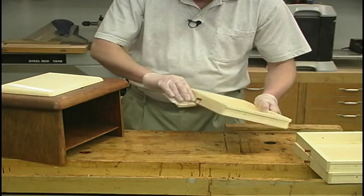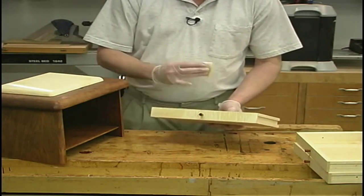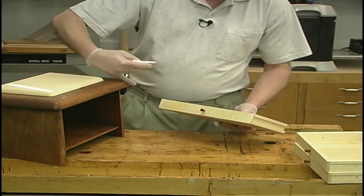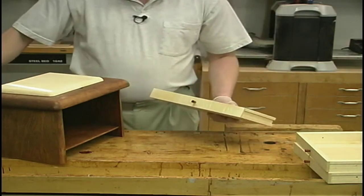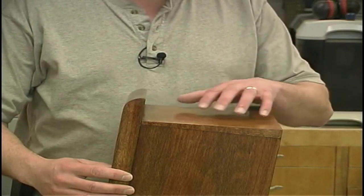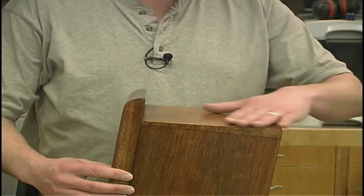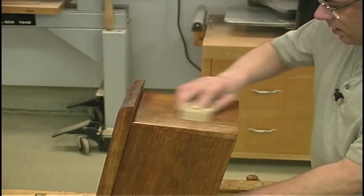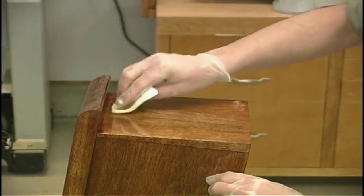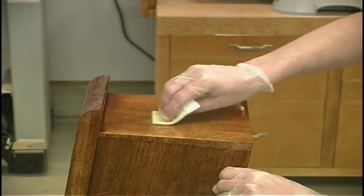I'm wiping on the top coat at this point — I'm using an oil and urethane product. You'll notice that I'm applying the oil and urethane first to my maple pieces, the pieces that don't have stain, and then I'll apply it to the actual cabinet that has stain on it. If I were to start wiping the top coat onto the stained component, I would pick up some of the coloring and transfer that to the maple. I'll apply probably three coats of this product, sanding lightly between coats with 600 grit sandpaper. After just two coats of the high gloss polyurethane, I'm not pleased with the look — it's too plastic looking. So I'll be sanding it down yet once again with 600 grit sandpaper and switching to a satin polyurethane to tone it down a little bit. Apply it with a cotton rag wiping with the grain, and once you have the surface wet, even it out by dragging the wet rag across the surface with the grain — very light touch.